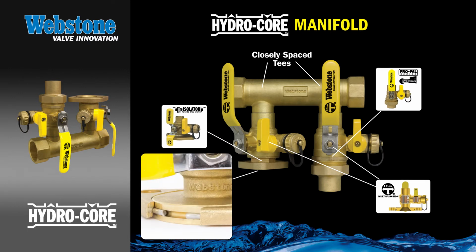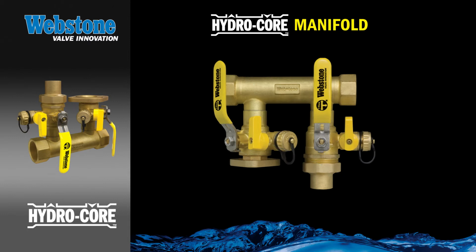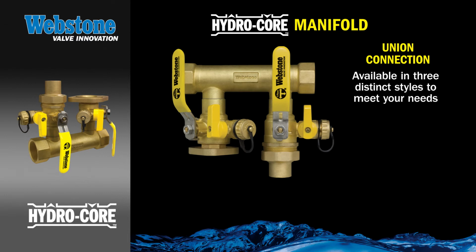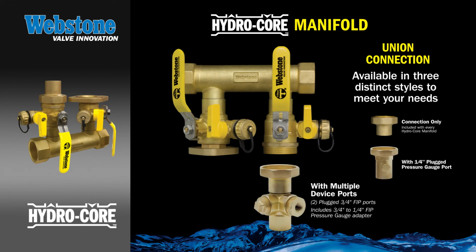The snug-fit 360-degree rotating flange offers greater flexibility to orient the pump during installation. And the manifold is fully insulated with EPDM foam insulation, saving the hassle of custom fitting off-the-shelf insulation on the job site. The Hydrocore manifold requires a union connection to connect the ball drain side to the rest of the system. Webstone offers 3 different connection styles to choose from: a basic union, a union with 1/4-inch plugged gauge port, or a connection with multiple ports should other devices, such as low water cutoff or indirect water heater, be required.